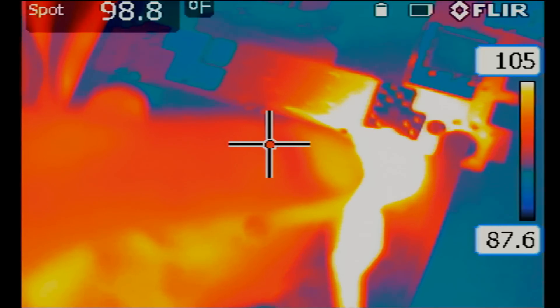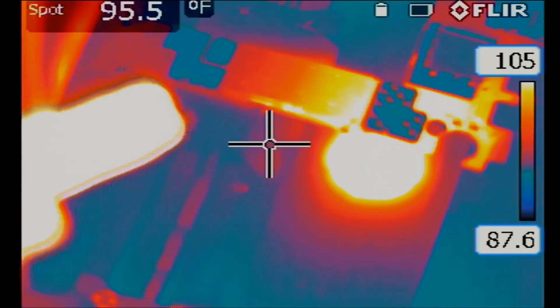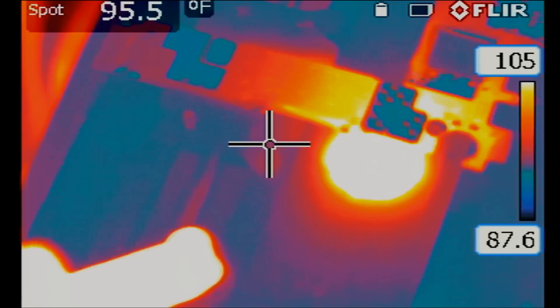The other tip was sufficient to desolder pads when we used it last time, but this one I would say is about 10 times better. I removed my hand and look — almost half the board got hot just from touching the solder wick onto that metal shield. And look at how long it's taking for the board to cool down because there's so much heat in it.